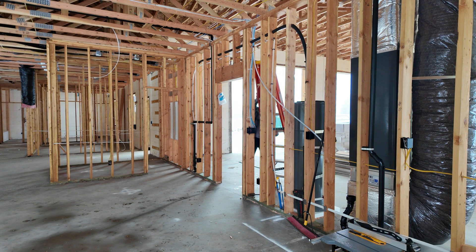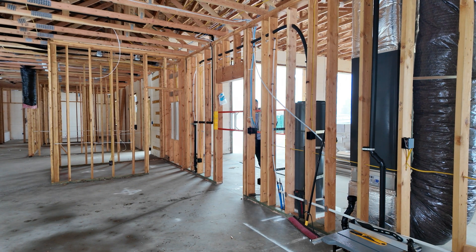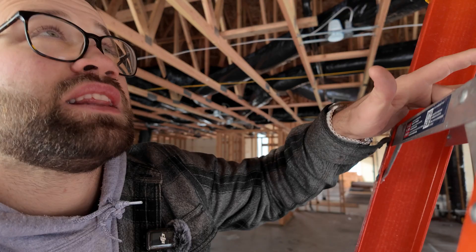I'm going to find the ladder and walk up to this top plate to show you what this connection looks like. I know there were a few questions regarding this portion of the build. In a traditional build, you essentially set your truss on the top plate, toenail them, then go back and either screw a Simpson SDS screw from the bottom or install hurricane clips. This is just essentially another way to fasten it.